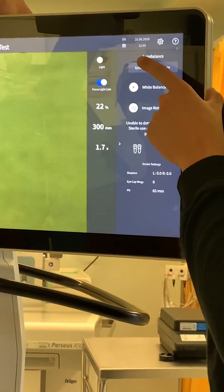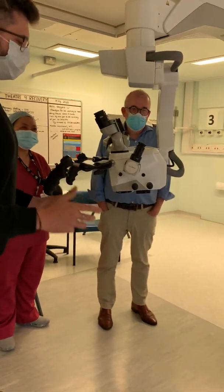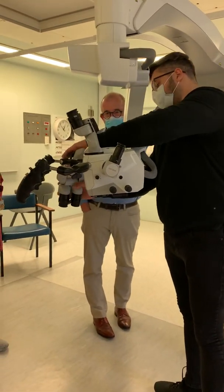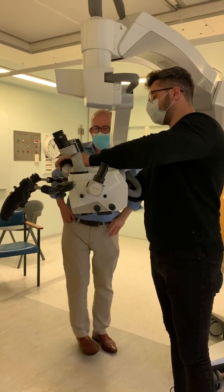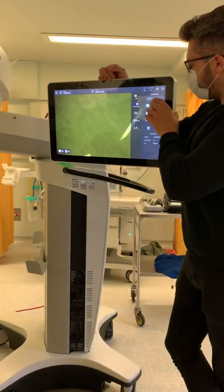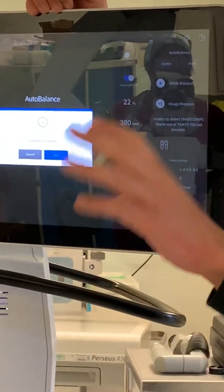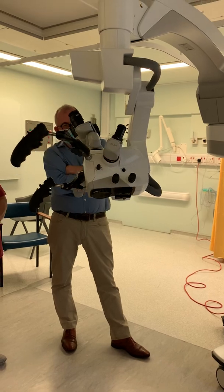On the side there's a little side menu controlled with this arrow. The most important item is System Balance. Before starting up, get the microscope in its final position — change over the arms if needed, but make sure it's positioned as close as possible to where it will be used. Press System Balance, confirm you're not over the patient, press Start, and it will calibrate all the motors. It takes about 10 seconds and runs through its little routine.